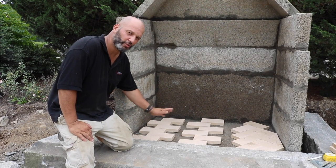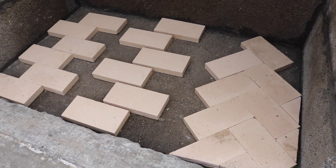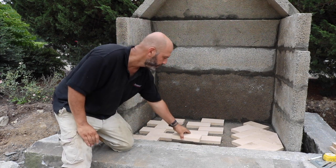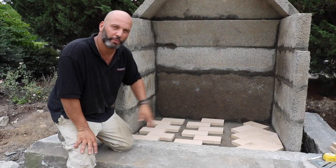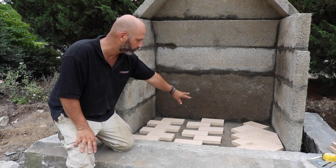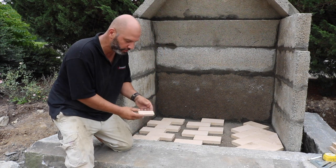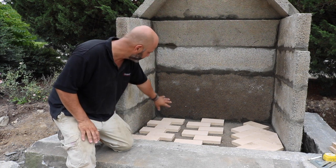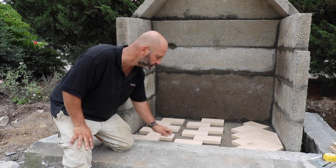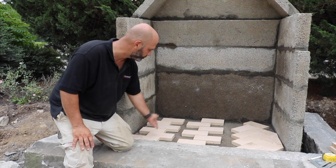We're about to install our fire brick and there are many options. The first option is tight joints, allowing ash to fill in the joints over time. There's also a three-eighths joint, a one-eighth, a quarter, or even up to a half inch. The key is you never want your joint to be wider than half the thickness of your fire brick. The last option is a herringbone pattern, which is very popular especially in Europe. We'll be going with the middle pattern — the three-eighths inch joint — which works out great with the fireplace flooring depth of 30 inches, with no cut brick needed on the back. Always find the center of your fire box — in this case 25 and one-eighth inches — mark a center line on your fire brick, start on that center line, work to the right, then to the left, to ensure your joints will line up throughout the project.